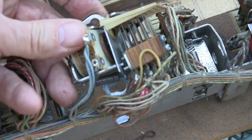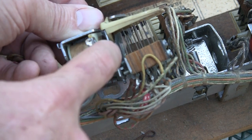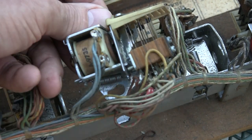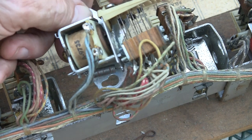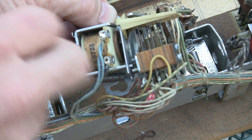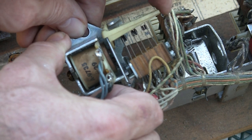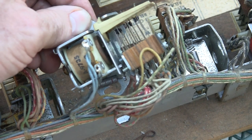What you see here is an electromagnet. This is the power going to the electromagnet — there's a little metal plate there. And then these are what are called switch stacks: they're literally stacks of switches, and they're called leaf switches because they're just little leaves sticking out. This right here is a little arm and it articulates — see the spring right there. This basically moves like that. So when the coil energizes, it pulls this metal plate towards it, makes the articulating arm move, and you'll see the little leaf switches move. That's how switches flip on and off in the game.